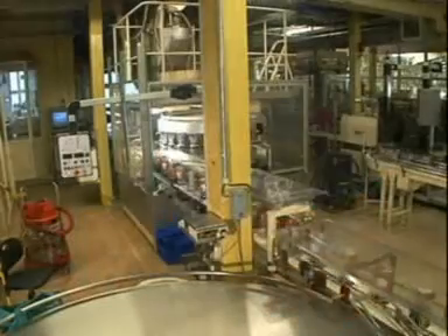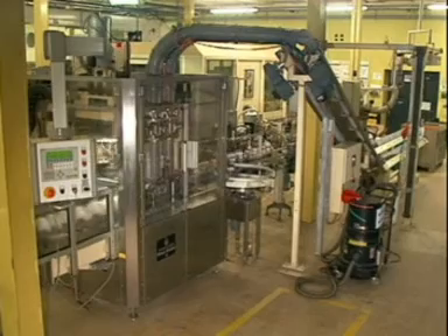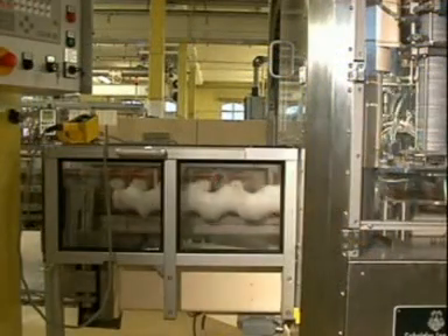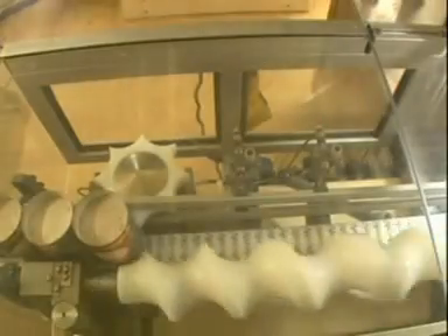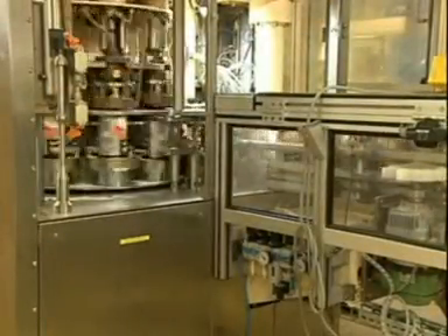On arrival from the filling unit, the cans are spaced by a feeding worm in the infeed area to match the tool stations. A driven dosing star, complete with its own monitoring unit, stops the cans exactly and pushes them forward a defined amount into the transport conveyor. The entire infeed system ensures the cans are carefully transported to the infeed star, which in turn feeds the sealing units.